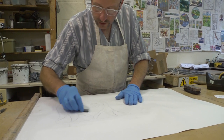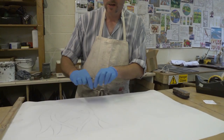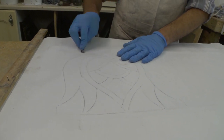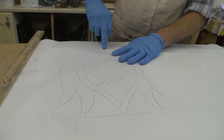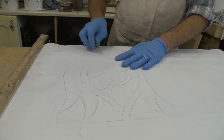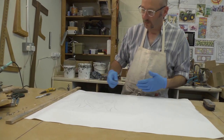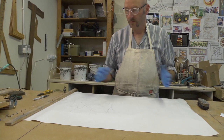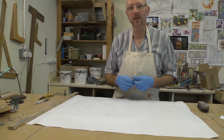So I'll try and stick to the guide, but you can see here, it will show me where all the glass has got to go and the lead back on top. And as the sides have gone, because the edge lead, if I get down to the, so that's where the edge lead is, that line there is the inside edge of the lead, and the rough line is where it's corroded off. So I want to mark that, but what I will do is I'll square it all up to make sure that I've got a square panel to the size of the wooden frame that I've taken it out of, and then it will be time to take the panel apart.